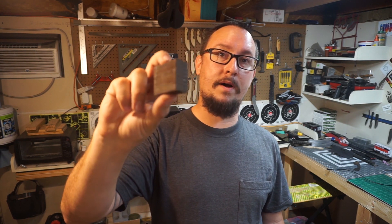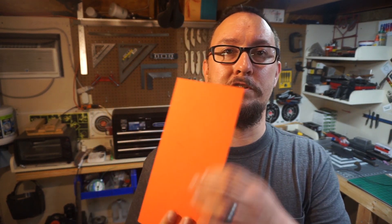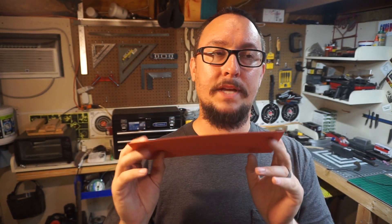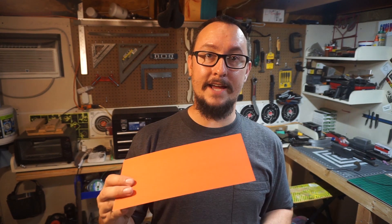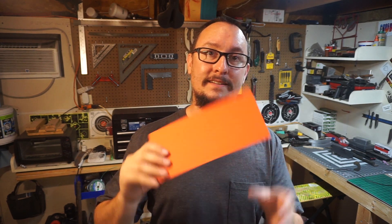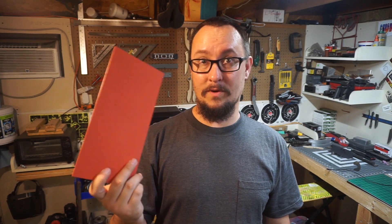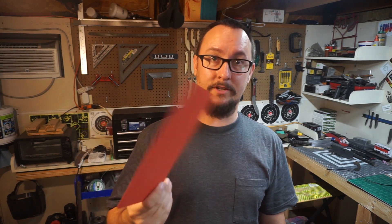What are we gonna be using? We're gonna use a little bit of zebra wood, the rest of that black palm, and red vulcanized paper liners. It looks kind of orange on camera but these are red. I know a lot of y'all are used to using G10, but think about getting vulcanized paper and trying it out. It's nice because all you have to do is cut it with scissors. It buffs and polishes just like G10 — absolutely amazing, really easy to work with. I'll leave a link in the description. They're not expensive, so try that out.